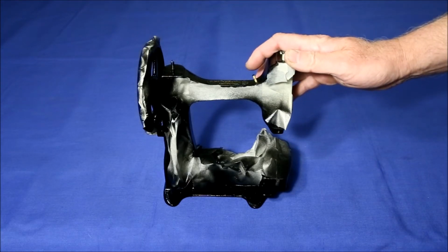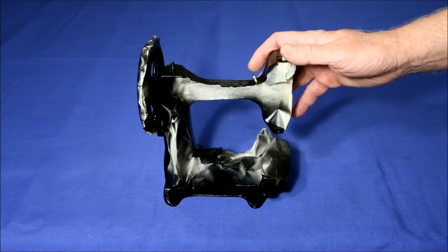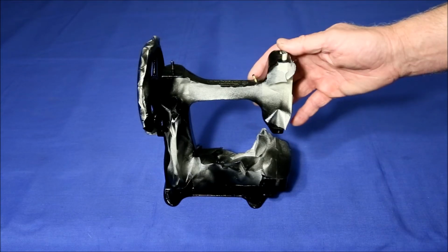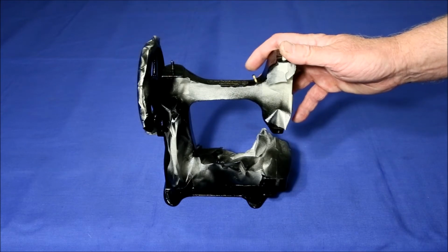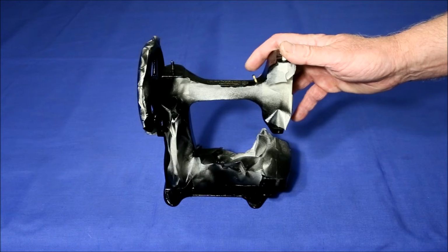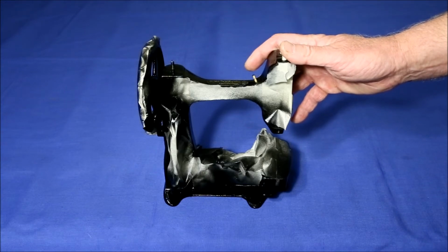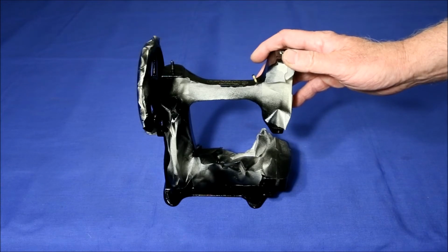The best way to repaint a sewing machine is to take it completely apart. Use paint stripper to get down to the bare metal, grind off any rough molding errors, sand down the high points, use a 2K high build primer, sand that down, repeat, then spray with a 2K gloss black paint, follow that with a couple coats of 2K clear coat, buff that down to a high glassy finish, and you'll look great. Sounds fine, but it's a slow, messy, dangerous, and expensive process.